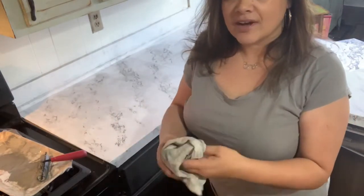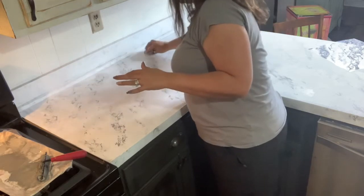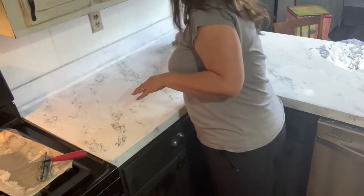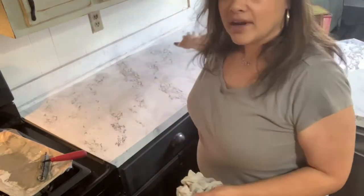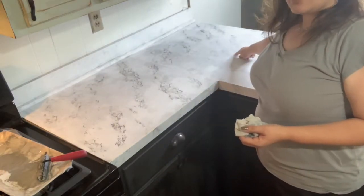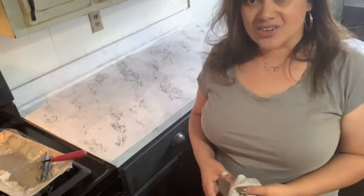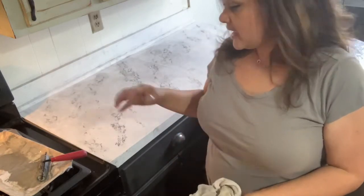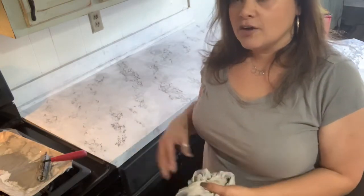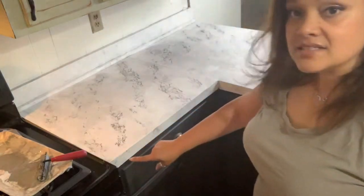Because we're using a chalk-style DIY paint, it is water activated. So if I have too much in one area I can easily wipe it off. I do just a small smudging rocking-back motion because I don't want to take off the paint underneath. You could even do a thin white coat over it with the foam roller — it still shows the gray veining but makes it more subtle. You can do this black and white, dark gray and white — whatever colors your counters are will determine how many base coats you need.